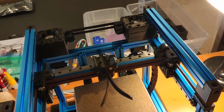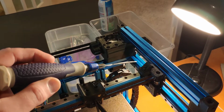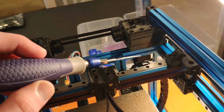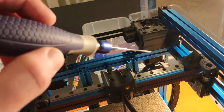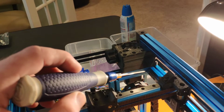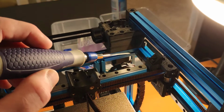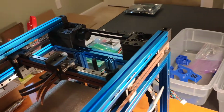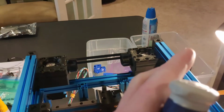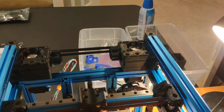However, this entire extrusion was being twisted slightly. And what was ultimately causing it, this top extrusion here that's part of the whole Z assembly, this one right here across the top, the end cut on that extrusion was not perfectly square. It was ever so slightly slanted. So, when I tightened up this blind joint, it caused this entire extrusion to twist. Just ever so slightly, just enough to cause this rail to bind up really bad anytime you tried to rack